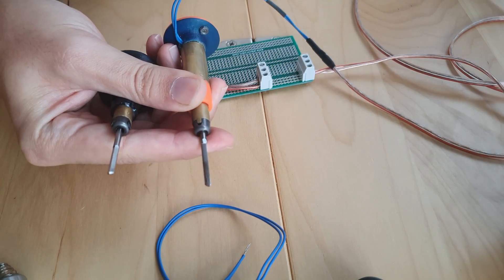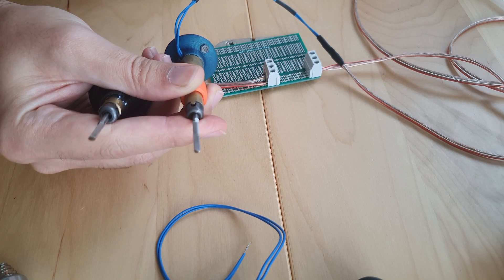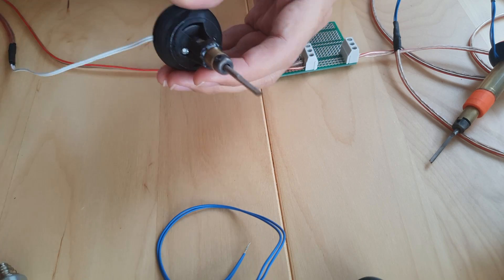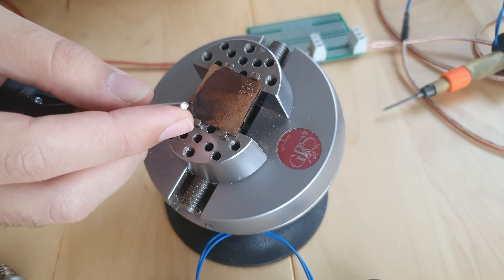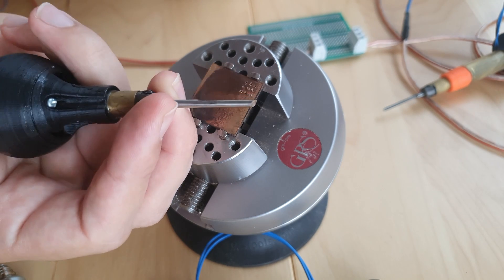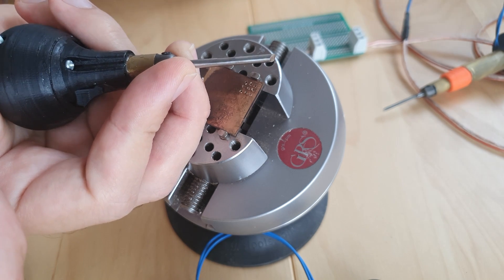I can use two hand pieces in the machine and just switch to the next one. I'm going to show first the one with the 6-volt solenoid. I'll switch the PWM code — I'm not using any magnification assistance, no microscope or visors. I'll change the voltage first; you can hear it clicking. It's not even reaching the metal right now, and I'm gradually increasing the PWM — sorry, rest in peace headphone users.